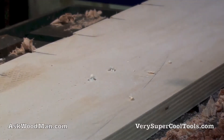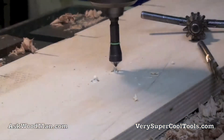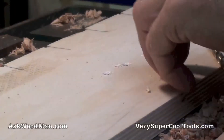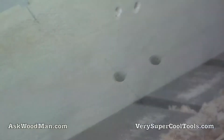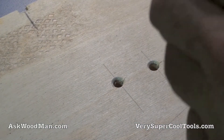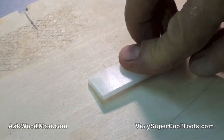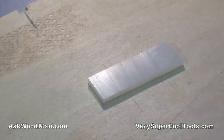Since that edge is so sharp, I don't want to booger up that sharp edge of the UHMW. So I'm just going to take a whisper touch to bevel and chamfer that edge so it just pops in there real nice. Counter-sink — that's what I was trying to think of. It's been a long day. Here are my two holes. You can see this UHMW won't stay flat, so it's not good for table saw fences like a lot of people try to make. It really works great in these little sections where flatness is not as critical, especially if it's getting pulled straight.